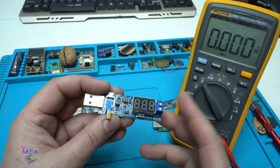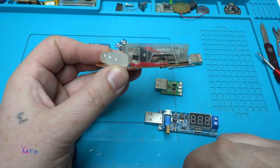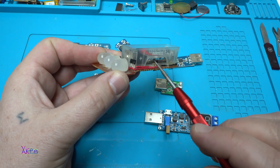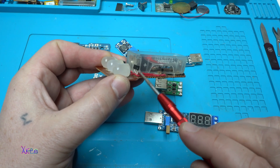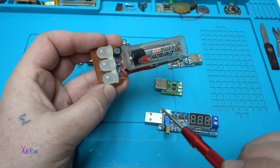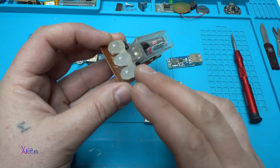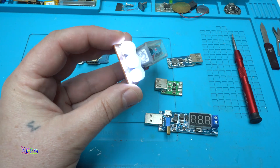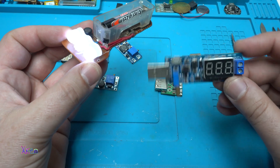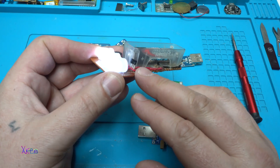Let's see now — this one. Even this, my homemade flashlight that works with only one AA battery, has a DC converter. Here it is — it is a very small integrated chip that converts the voltage from 1.5 volts up to 3 volts, just enough to light up the LEDs. And this is the same thing, but this board can handle a little more current, and this one is for lower current.